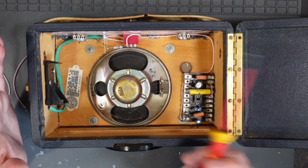Next step is going to be to wire up the earth, which is a bit of a challenge. So our earth lugs are going to be lug 1 on both of our pots. This lug here is going to be the earth for our circuit down here. Also, we want to add in an earth for our jacks, which are of course on the back plate. I'm going to do them last. Right now I'm going to run a bar, or just a solid piece of wire, from this lug to this lug, and that'll give me a staging post where I can connect this to it, and I can also connect a wire coming from the circuit to it too. That way I've got a solid earth, and also not to forget the speaker, so I can get them all wired into one bus bar, if you like.